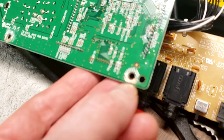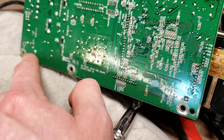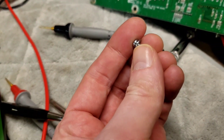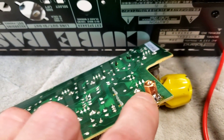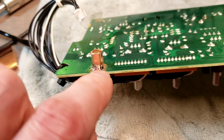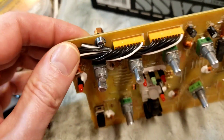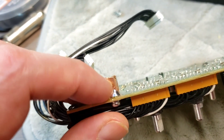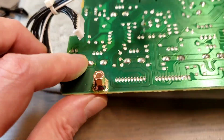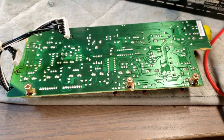They're going to have to be bolted up to this side, so I've scraped away some of the solder mask to make sure there is a good mechanical connection. It still has to go through the screws unless I decide to solder on the other end as well — makes it a little less disassemblable, but not too bad. I've only soldered to the copper foil on the outside, which is just adhesive tape on the posts, so you can unscrew it — it'll just rip the tape off the post. That's the solution, and you can thank Roland for giving you a similar dilemma if you own this amp.